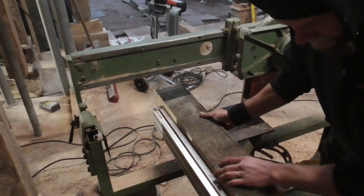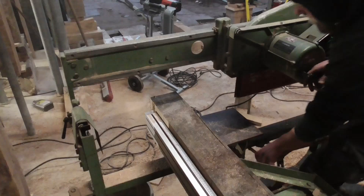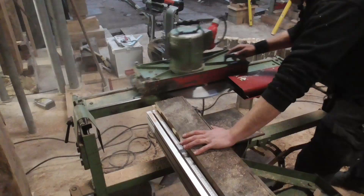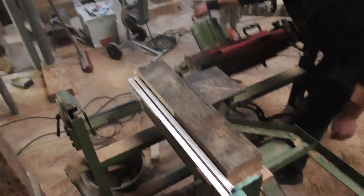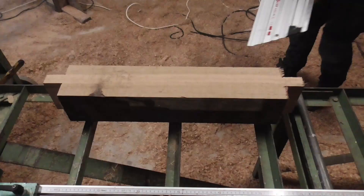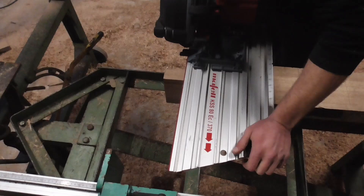You should keep in mind that this is not the normal way to do it. We can do it here because we are restoring a complete wall with all the stands and all the crossbars, so all the spigots have the same size and all the stands will have the same size — we are able to unify things a little bit. The general adjustment of this machine is really time-consuming, so it only makes sense if you want to manufacture more than three, four, or five crossbars. If you only need one or two for your restoration, it is definitely faster to manufacture them completely by hand. As you can see, the result is definitely okay at this point and the beam could already be installed in this form.